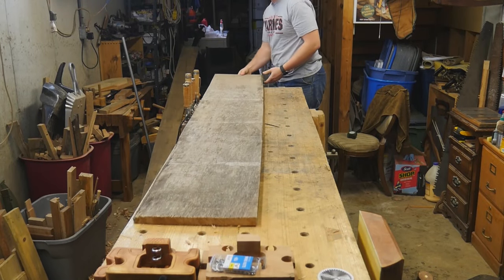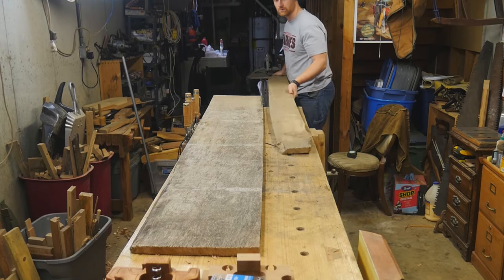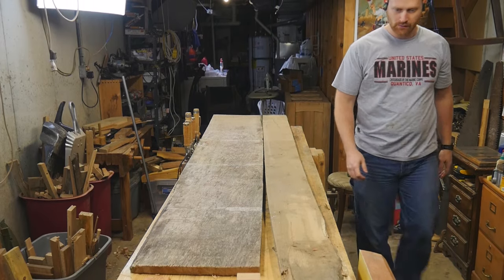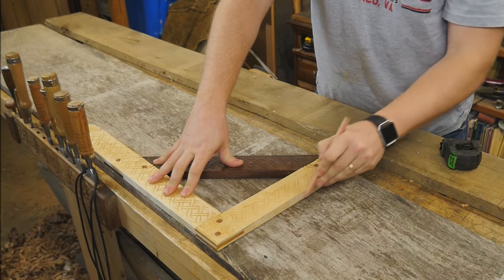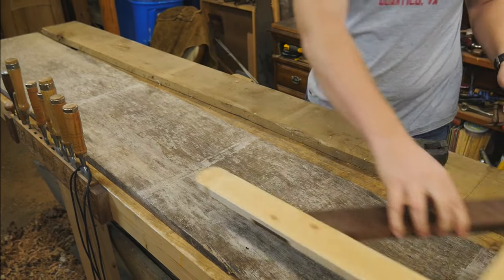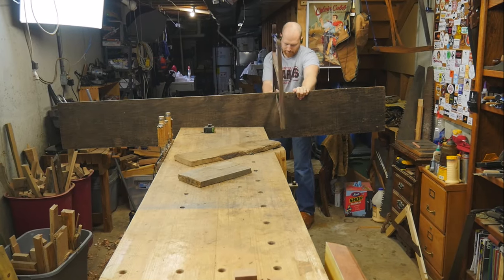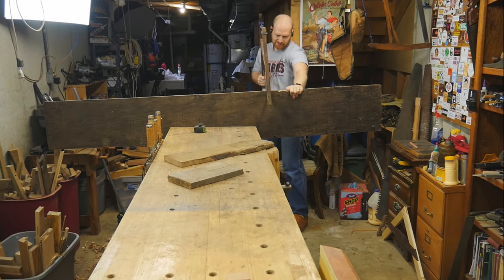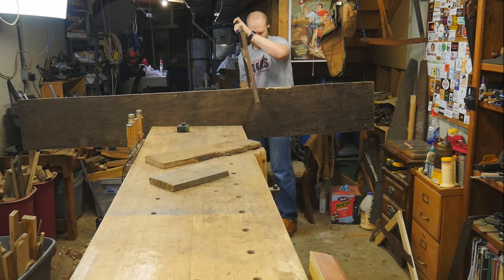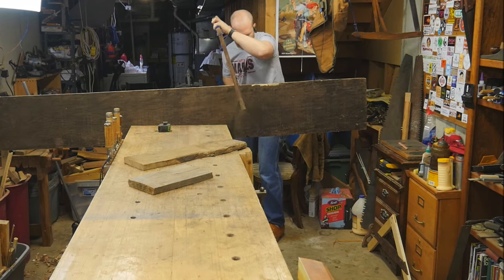For the top I wanted to do something a little bit different. I have this very large board I've been saving for a while, and a second piece with a good bit of interest — some cracks and oddities that I want to keep. I kind of made it match the bottom with an interesting piece and a straight grain piece to go with the drawer fronts. I start by squaring it off and figuring out how I want to cut these out. It's a little over five feet long on the top, so I make my marks with the square I recently made, and then cut it out. I love using this bow saw for rough, quick cuts — keeping it about an inch longer than it needs to be.